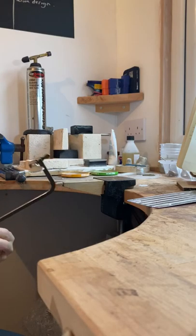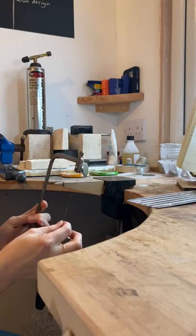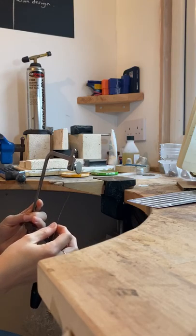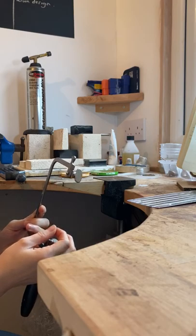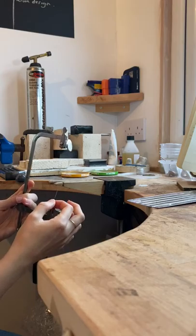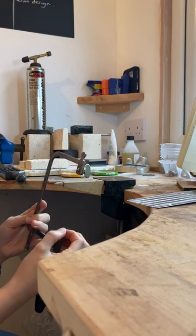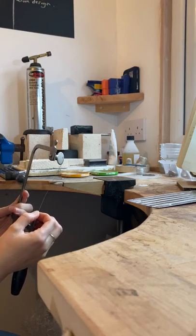At the moment this is an old blade which I'm going to show you how to take out. I've only just come into the workshop so the blade has been stored in only one clasp - that's the correct way to store it, because you don't want to over-tension your blades if you're leaving them for a few days without using them.